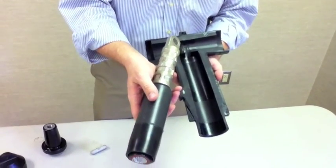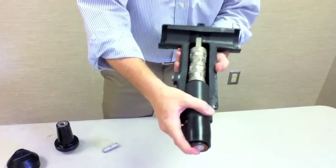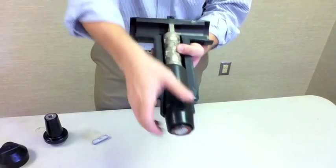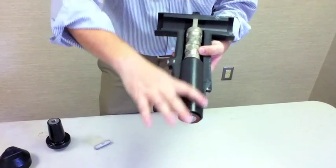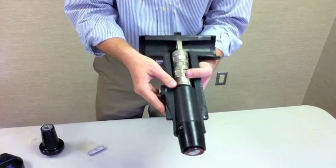After the cable has been prepared, you will insert the cable into the T-body, sliding up. Notice that the T-body has a gauge here, or a notch, that allows proper orientation of the cable inside the T-body. As usual with these products, you will make sure to clean and lubricate with the proper silicone grease that's supplied with the kits.